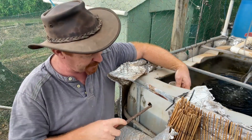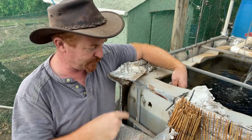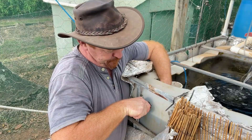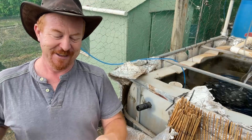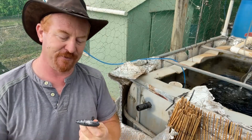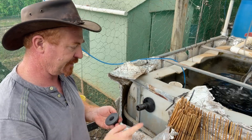I already used a round file to file the edge a little bit. If you use a hole saw that'll clean it up pretty well, but you still have to get those filings off. I'll push that through — it's a very tight fit, a bit tricky. There we go, pull it through like so, and then I'll silicone the rubber — it'll be easier that way. When you go to remove it later, you'll still be able to get the bulkhead fitting off because the rubber will be siliconed on.